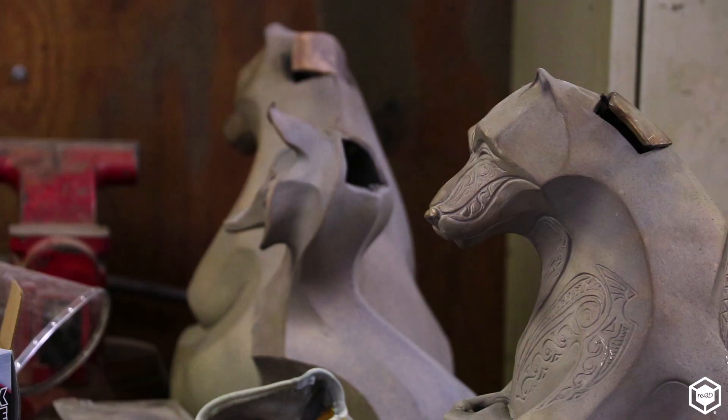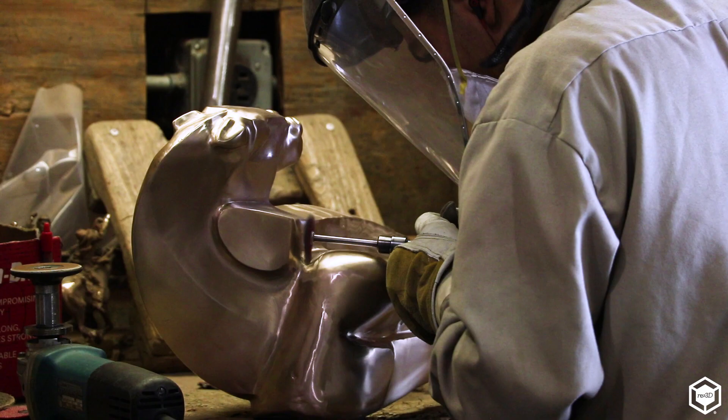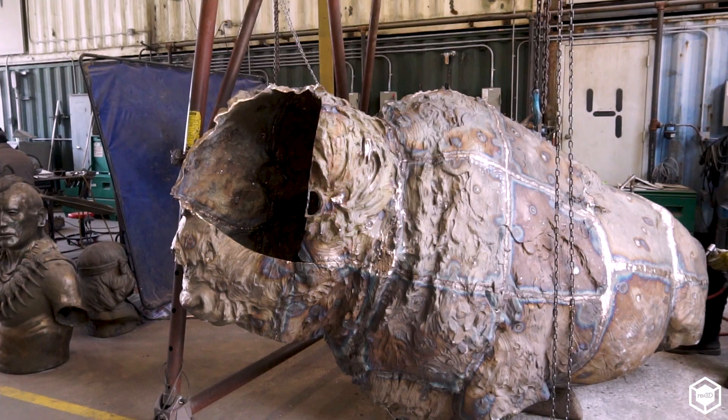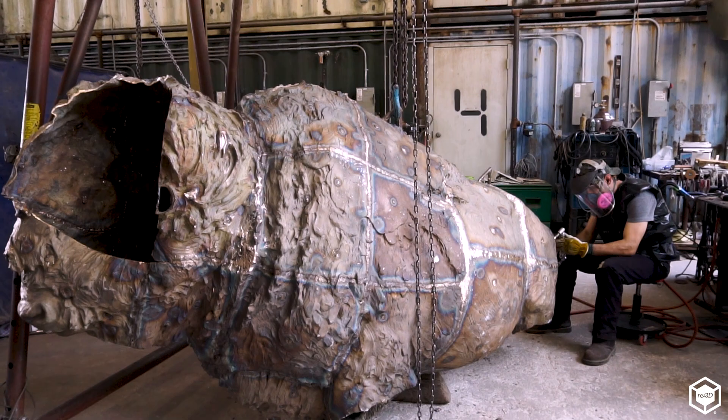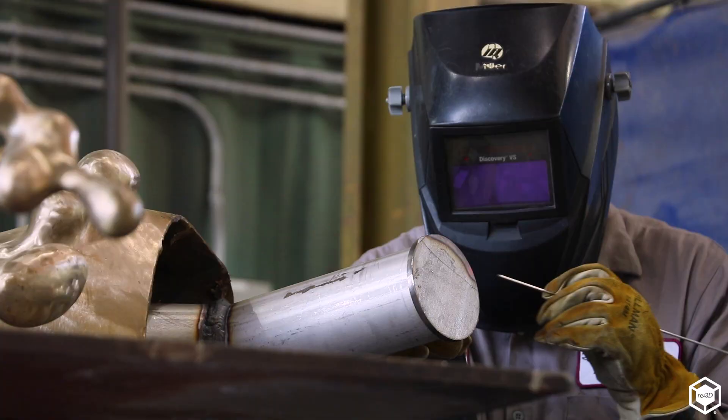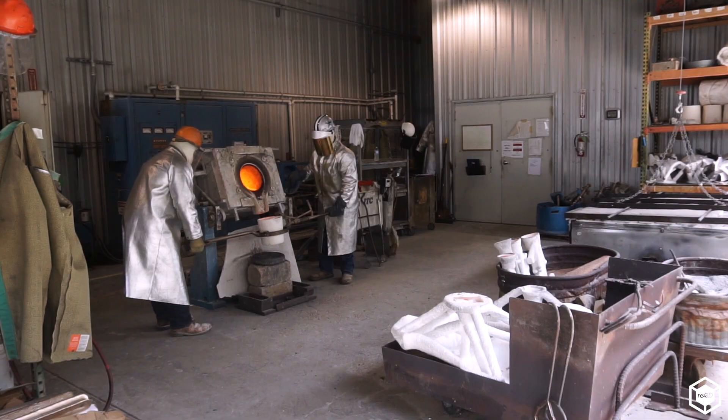The other thing we didn't really expect and that really jumped out at us is that there's no movement. Wax is innately flexible, and through the process of casting a buffalo like this behind me, it'll be cast in 30 or 40 pieces — each one of those sections has the potential to warp slightly. So when it gets put back together in metal, there's got to be some movement; we've got to bend those metal pieces back into alignment. With 3D prints, they don't move at all, and the assembly time on putting a monument back together that's been 3D printed is probably half of what it takes from a wax process.